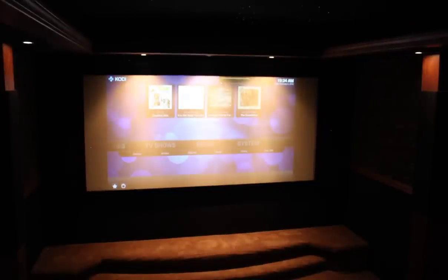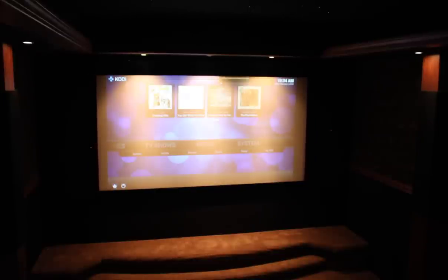These are built using basically completely off-the-shelf components. There's an Eagle Aspen Rotor 100 antenna rotor, which is unique in the fact that it has programmable stop points. It's connected to a large pulley that pulls the cord on a curtain track from Ikea. That then ties to the masking panels that you see. They're rigid panels framed with window screen frames, then with the same material stretched over them. That covers the bottom half of the walls, which is mostly acoustically transparent. The inside edges have some black velvet to help catch more of the light that might over-spill.